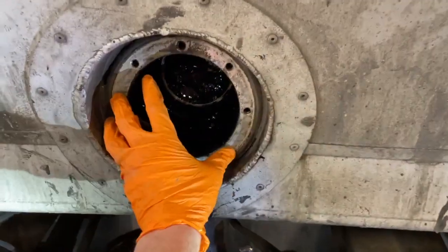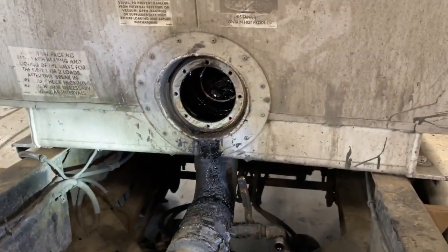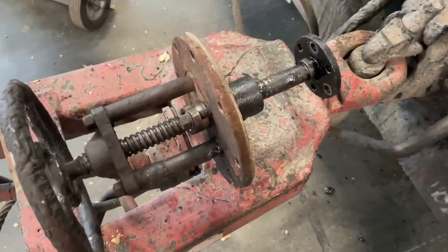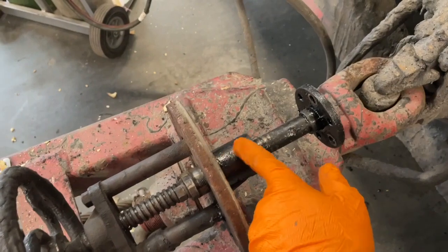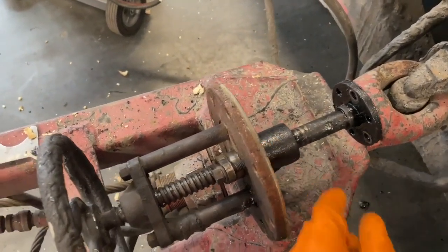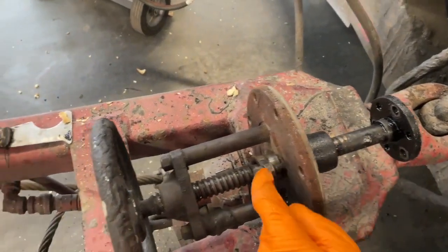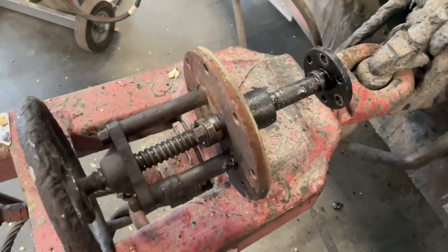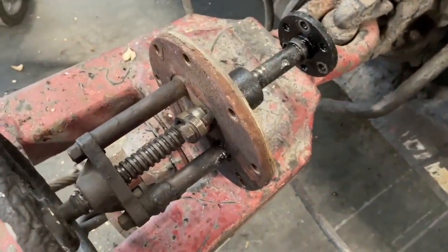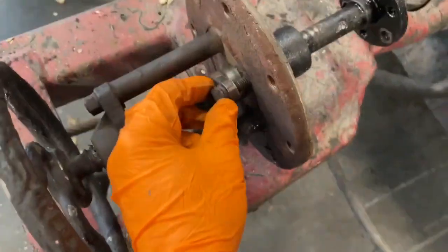This is your manifold, this is just the barrel, and the actual opening is like six to eight inches back inside. Valves have these throws that go through them, and there's packing inside which is what stops oil from coming through this pipe and coming out. Packing can wear out and start leaking — that's how packing works. If you see oil start coming out of here, here's what you do.